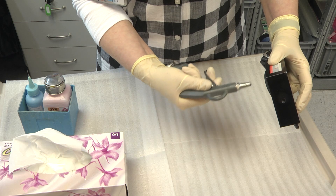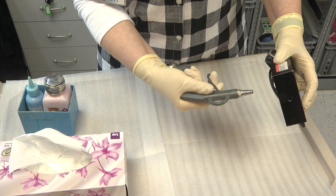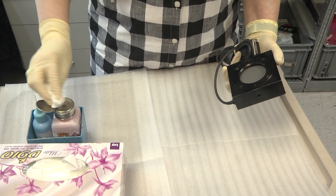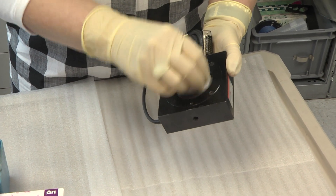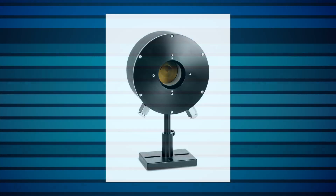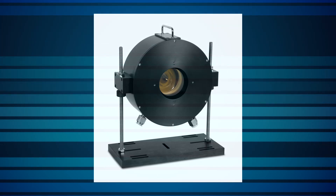This will lift most of the dust or other contaminants from the sensor surface, and then gravity will do the rest. When air cleaning is not enough, our usual recommendation for most absorber types is to simply use a tissue with a suitable cleaning agent. There are certain sensors that cannot be cleaned with such cleaning agents, but rather only with clean blown air. A table of recommended cleaning agents for each of the different absorber types can be found on our website.